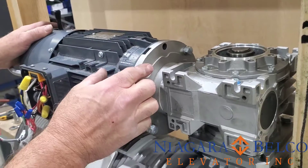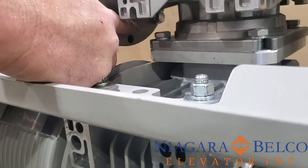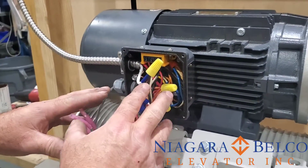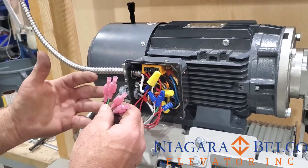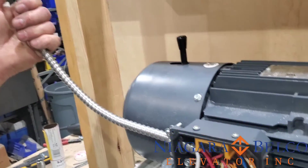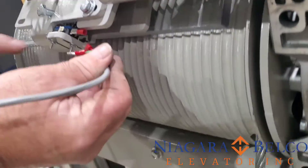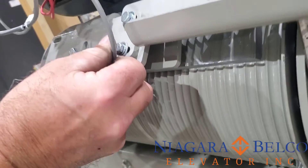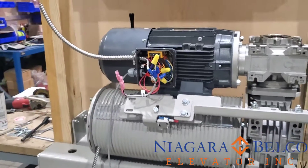Now that you've installed the motor and put your bolts in, you're going to tighten those bolts up. You cannot always access the one right in the back here, but it is not necessary to even install it — three bolts will suffice for this. Now you can do your wiring: your wires are here for your brake to hook into, you'll run your wires up for that. This is for your motor — you'll connect that to your controller. This is your safety switch, which will go on here. We'll do another video shortly where we show you the termination points in the controller.